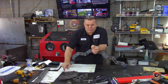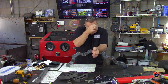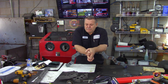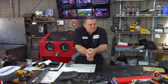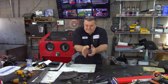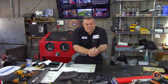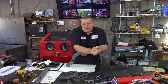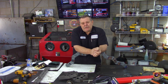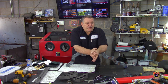A couple things I've learned: my current welding table is 5x10 with a 3/8-inch thick steel top — it's not thick enough. When you weld on it, heat warps it. I asked my brother about building another table and for now we're thinking a smaller welding table. I might buy one of those Certiflat welding tables with fixture holes already in it — nothing big, maybe two foot by four foot, just to see how we like it. This table is also too high for TIG welding.